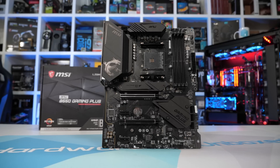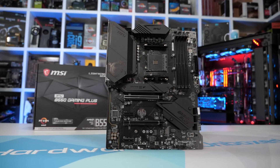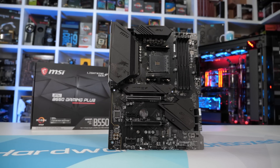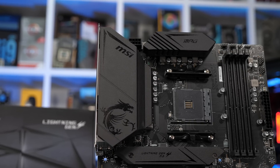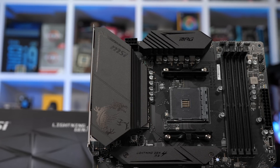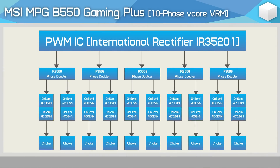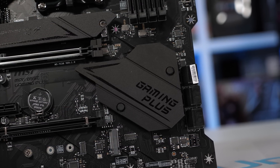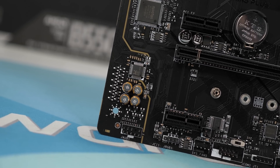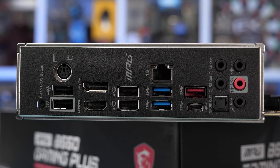The last MSI Gaming Plus I looked at supporting Ryzen was the X570 Gaming Plus at $170 US, which was pretty awful in terms of VRM quality given the flagship chipset — really entry-level B-series quality. Improving on that is the $150 B550 Gaming Plus, which takes the X570 Gaming Plus VRM and expands its capacity by 25%. MSI now takes five signals from the PWM controller, adding two extra sets of MOSFETs. For just $10 more over the B550A Pro, you get a few nice features beyond just the larger VRM, including a pre-installed IO shield and larger heatsinks, but otherwise it's essentially the same board.